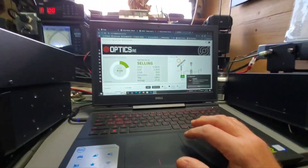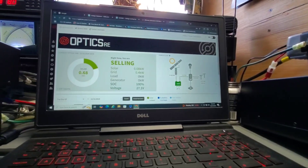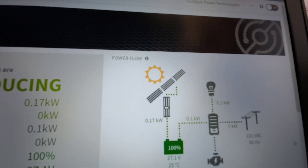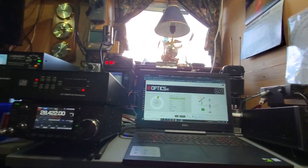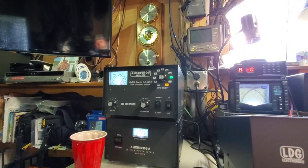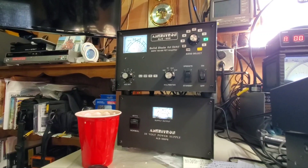Right now I've got my solar showing up — my Outback optics are on. I'm making about 400 watts, sometimes 600-700 watts, but some of this is the battery. We just got some cloud edge effect and right now it says 100 watts load. I've got 120 volts out of here — I don't have enough room for 240. Back in August I purchased from DX Engineering an ALS-606, so that'll give me 600 watts. It's only drawing about 100 watts — that's the linear power supply to run the amplifier.